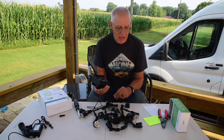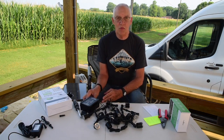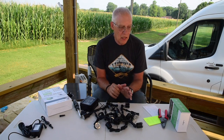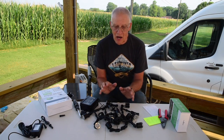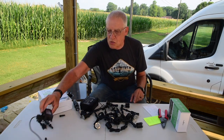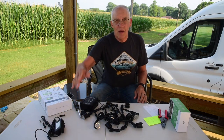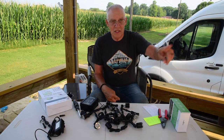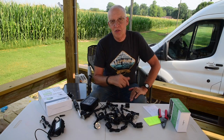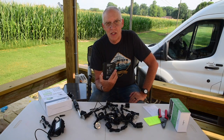That's really all there is to it — it's a nice small unit you can fit anywhere and it controls your lights really well. It doesn't work just with SMY lights; it works with any 12-volt LED landscape lights or a variety of different situations. Now I don't have to use two of these for my two sets — I can connect them all together and run them into this one SMY 65 watt transformer.